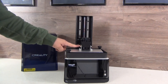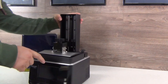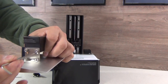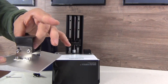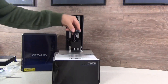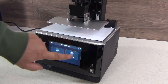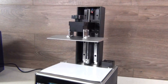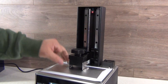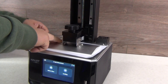Generally, the printer arrives with a factory calibration, but in case you don't trust these settings, I'll show you how to calibrate your printer yourself. For this purpose, it's necessary to remove the tray and loosen, with the Allen key provided, the four screws of the build platform as shown. Then, you place a piece of paper on top of the screen and mount the build platform in place. From the printer menu, select leveling and wait for the platform to go down to its home position. Next, you gently press the platform against the screen and tighten the four screws in a criss-cross pattern. This way, you will ensure an even fit on the platform to ensure perfect first layers.